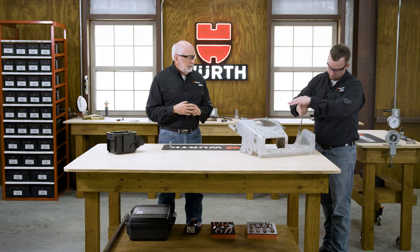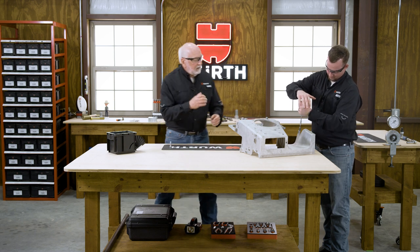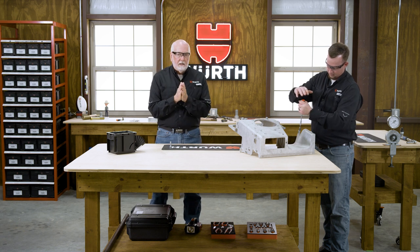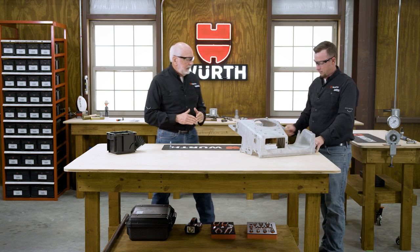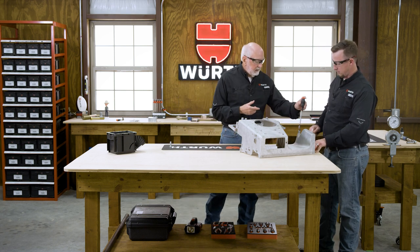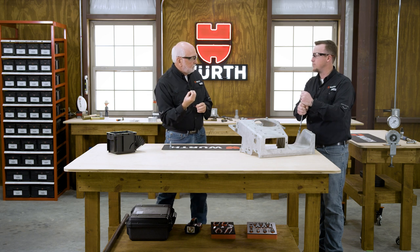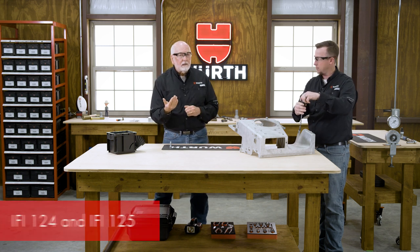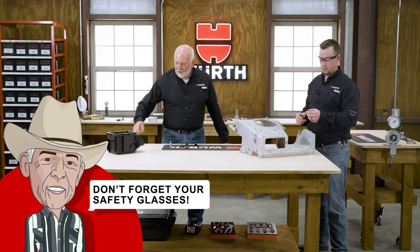Once those threads start forming, your driving torque goes lower. First you have a peak on your drive torque, then as you roll those threads, it goes down. What's really cool is you can take this screw back out. When you remove it, pay attention to what we call prevailing torque — in order for that screw to back out, it also has to overcome those high points on the trilobular shape. This resists vibratory back-out equivalent to the IFI 124/125 specifications for locking elements on screws.